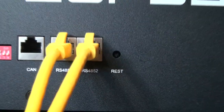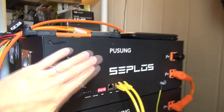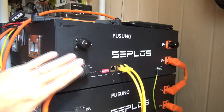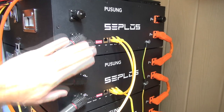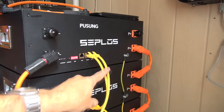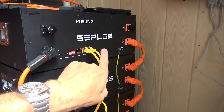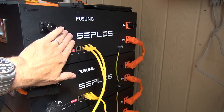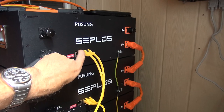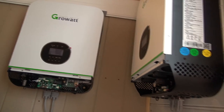When these arrive, they'll be in a kind of sleep mode. There's a reset button that can be used to wake the battery up, and that also makes the terminals live. You don't want the terminals live when you're connecting them. I had them live and saw a spark — I'll explain why that happens. You can wake all the batteries up by having all the interconnects in place and pushing just the one reset button. You can also put them back to sleep. I would leave the communication cables to last so nothing gets accidentally pushed.